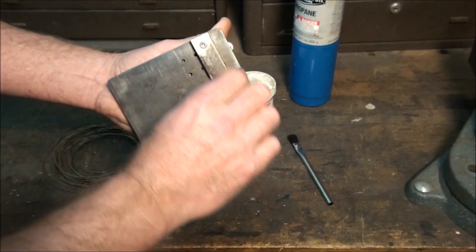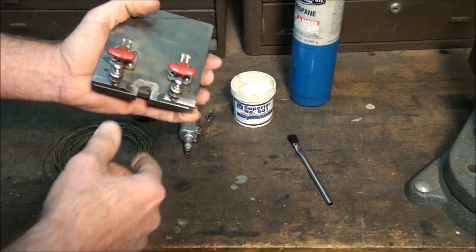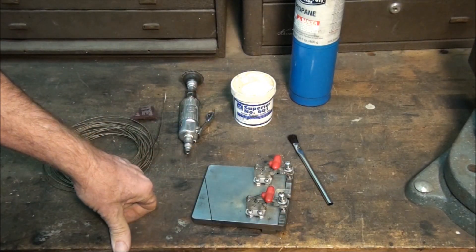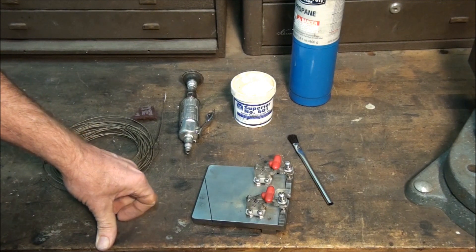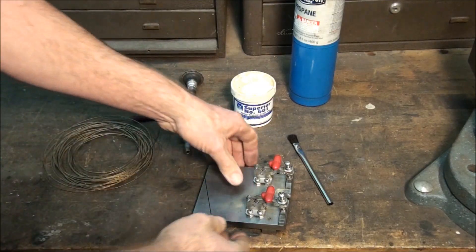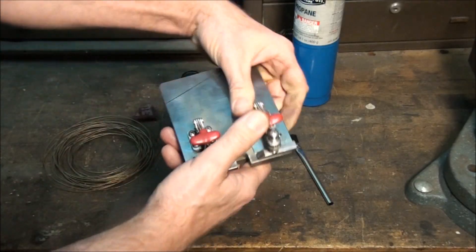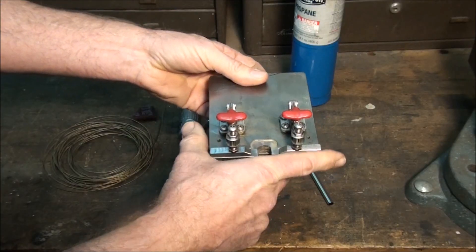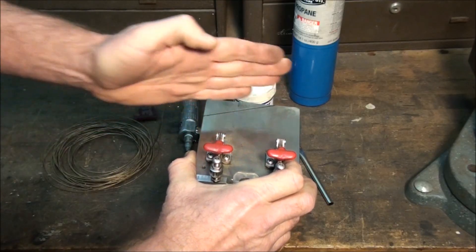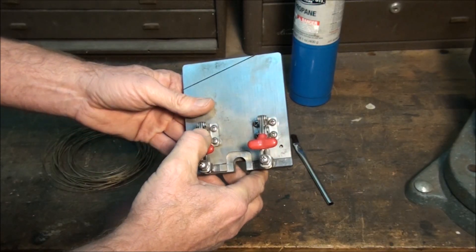The fixture has a key in the bottom to fit my belt sander, so I can set it on the belt sander to cut what's called a scarf joint on the end of the blade. You can't just butt these blades together — you need more surface area than that for them to be strong enough. So you have to grind about a 20 degree angle on each piece where they fit together so they overlap a little bit. The saw cut in the fixture is 25 thousandths wide on a 20 degree angle, so I can push the blade against the belt sander and get a perfect 20 degree wedge shape on each end.